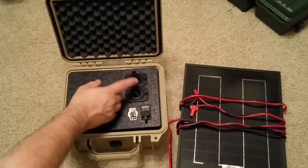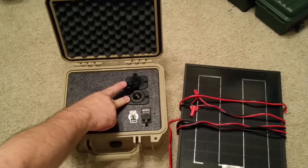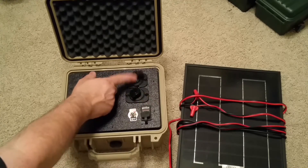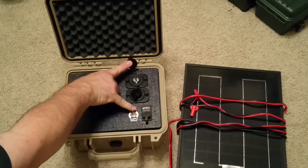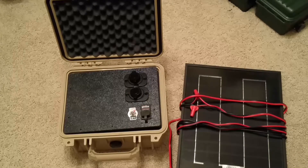One cool thing you're wondering — what can you do with this? Well, with 12-volt output you can plug in anything that goes in your vehicle's cigarette lighter: your flashlight charger, your car charger for your cell phone, anything like that. And then of course you've got the USB ports. Now this is a 2.1-amp USB, whereas a lot of smartphones today go up to 2.4 for fast charge, so it won't do that — I bought this two years ago before 2.4 was common. But it charges my smartphone, a Samsung Note 4 with a big battery, just fine. Plenty of power to charge it over and over.